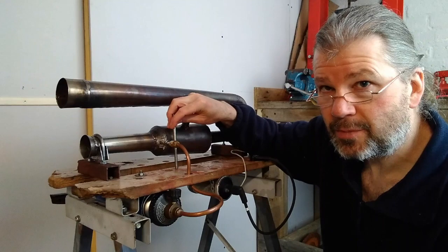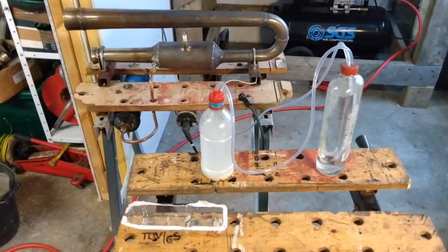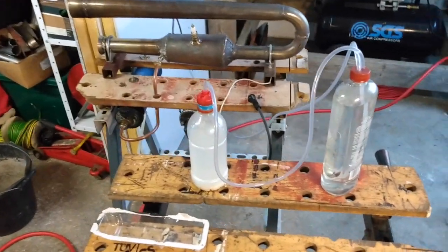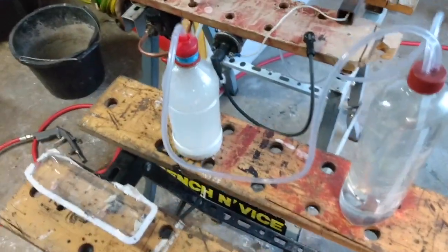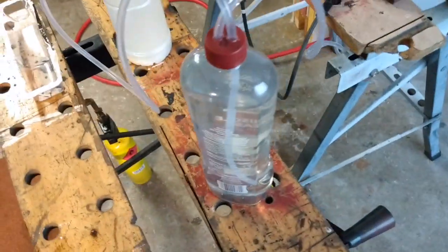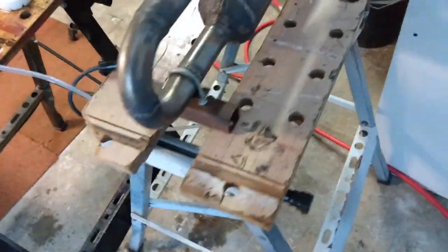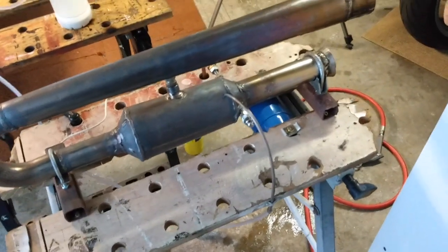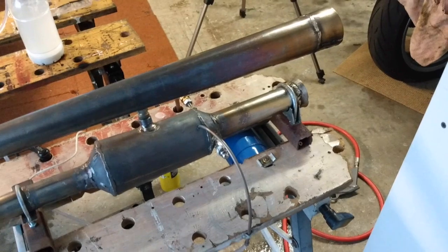I'll probably save the liquid fuel stage for the next video. All set up now to try a little bit of homemade acetylene in the pulsejet — I'll idle it as before on the little gas cylinder, then drop some calcium carbide into my acetylene bottle. It'll bubble through the water to stop it flashing back. I've pre-purged all the lines. Unfortunately a little bit of water ended up in the pulsejet, so I don't know exactly what that will do, but we'll soon find out.